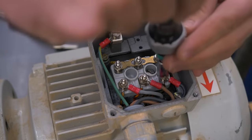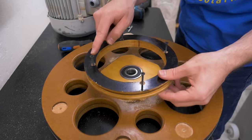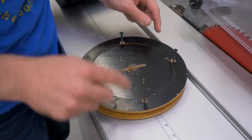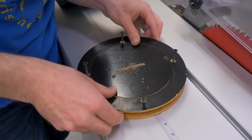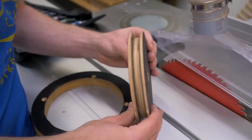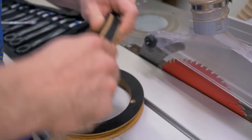Here you can see how it's wired up in star. All this time the bandsaw was driven by four drywall screws. What's also interesting is that both pulleys were cut from the same piece — I was really trying to save material at that time. But if you look at the pulleys, they are in good shape. Nothing seems to split or crack, and the belt still has relatively good traction.